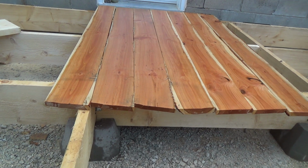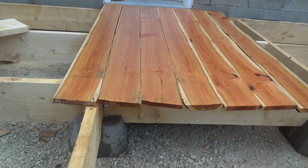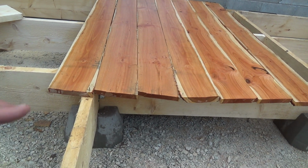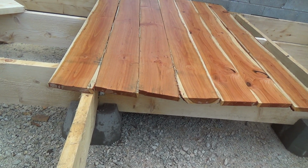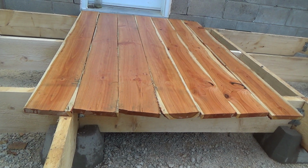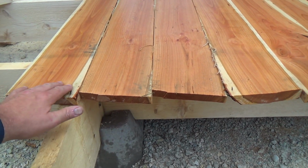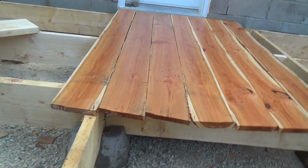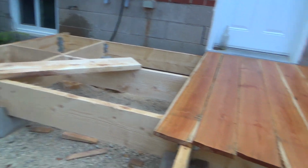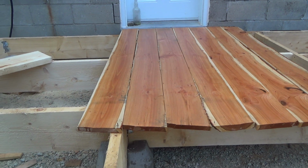1-inch stuff there, because those scales of theirs just aren't good. It's got such a fine scale, you go a couple of passes and you think you're on that 1 inch, and then all of a sudden you've got a thicker board, like an 1/8 inch thicker. So you probably should run these through the planer, but these actually didn't come out too bad right out of the saw. It's a lot better than the spruce. The spruce comes out really rough, but these actually don't look too bad.